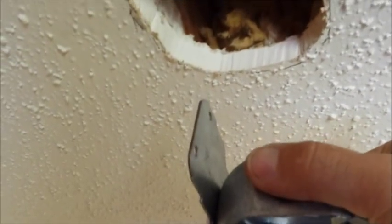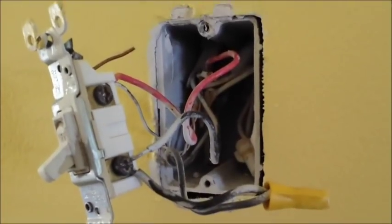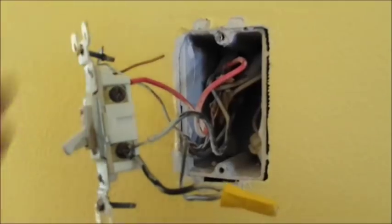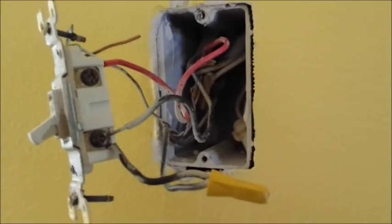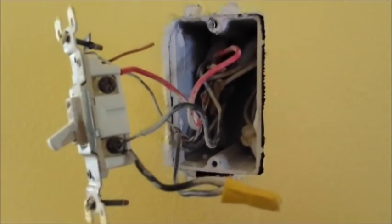So that's how we arrived at our location. Now folks, I really want to warn you here — if you don't know anything about electricity, this is not a job for you to attack. You need to start with getting some basic knowledge of electricity. Make sure the electricity is off at your breaker panel, make sure you've found the right circuit. Turn the circuit off, then come back and test the circuit to make sure that it actually is dead.